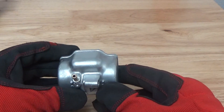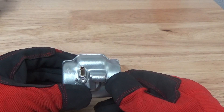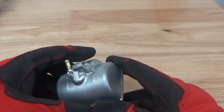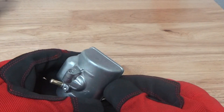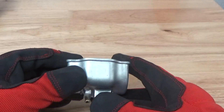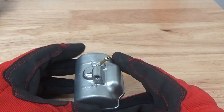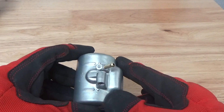The ceramic bead does hit with a little more force, which means it can break through some paint, some powder coat, some of the tough corrosion that you get on this aluminum sometimes when it's this old. It really helps to cut through some of the gasket material, some of the sealants, some of the stuff that you normally couldn't get with the glass bead slurry. And that's really one of the benefits. Also, the cycle times are drastically increased and improved — you get about 30 times to 1.